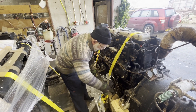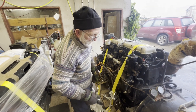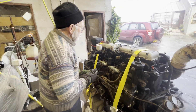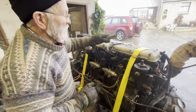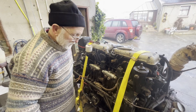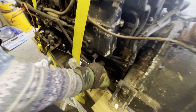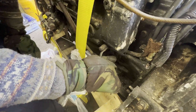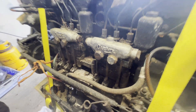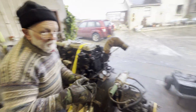They've come out of quite a historic vessel, and I'll take you through that at the end. We were told that these engines were running a short time ago. The first thing we do is operate the throttle lever and listen to hear if we can hear the rack going back and forward — and I can't hear it. I'd be fairly confident the rack is seized.